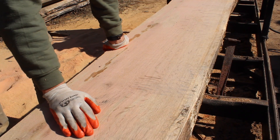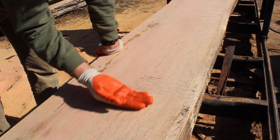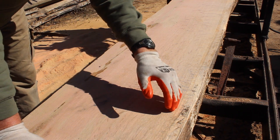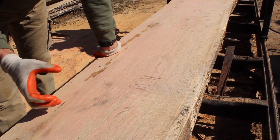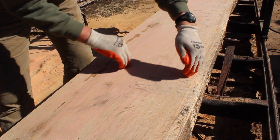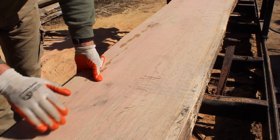I just made that first cut on the log and it shows you really clearly what's going on inside. This face is still nicely quarter sawn, and there's actually another board with this exact same face on the piece I just took off. This also shows you where the nice boards are — right here — and where the waste is. The very center is like the core of an apple; we're going to get rid of that. It's cracked, it's checked, it's low grade — good piece of firewood. So we'll cut that out and the board will be nice, straight grain with the rays going across it. We'll continue through this until the quarter sawn lumber falls off and then start working on the lower quarter.